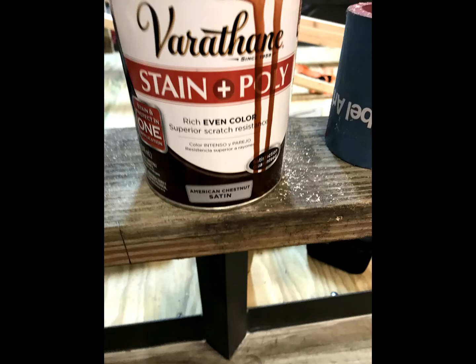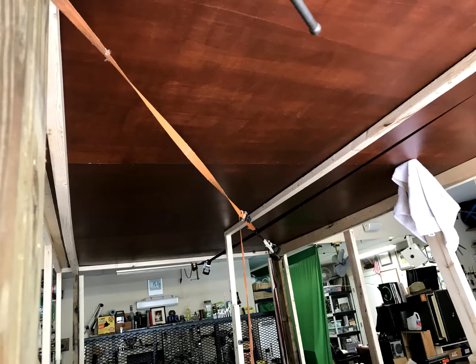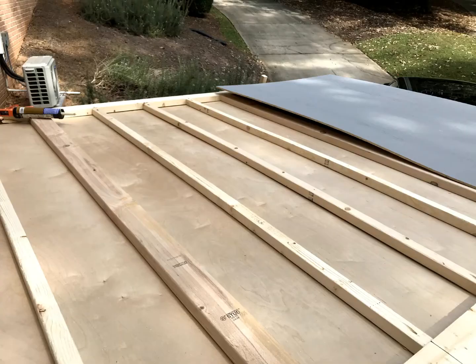Once the basic outer supports and roof frame were in place, I nailed up the ceiling panels and went to Lowe's for the insulation and siding. I used 1.5-inch solid foam insulation to completely fill the void between the ceiling panel and the roofing paneling to make it a solid sandwich. The same sandwich is used for the walls. That produces an R7 insulation value, and the roof is strong enough to climb up there and have an afternoon cocktail.